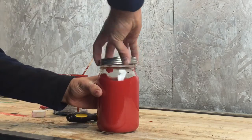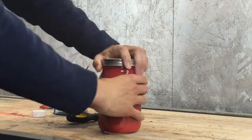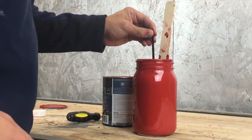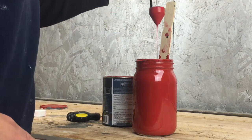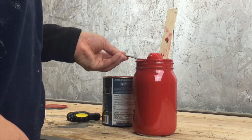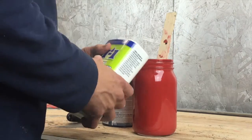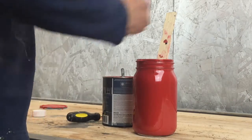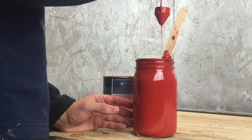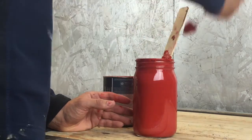The one thing you don't want to do is put too much of this additive in, because if you do it's going to be too thin, and you can't come back from too thin — you can come back from too thick, just not too thin. Now, that little dipstick actually comes with the sprayer I purchased, and it calculates how thin your paint should be before you put it into the sprayer, because if you put it in too thick it'll never spray properly. I had to use quite a bit of the additive since it needs to be a thin mixture for this type of sprayer, but once you get it right, you're good to go.